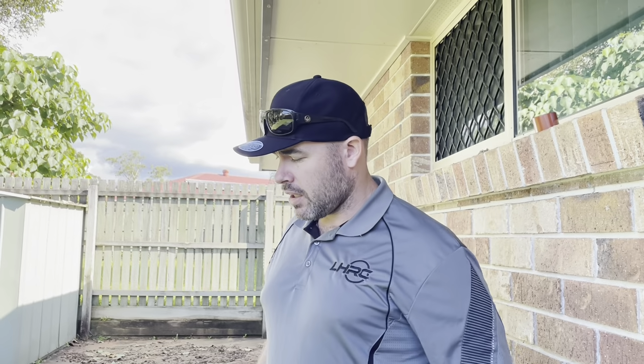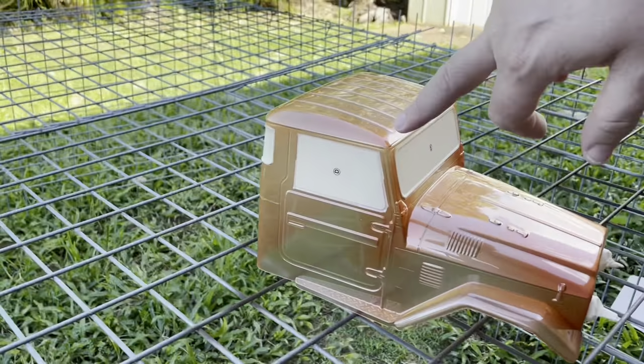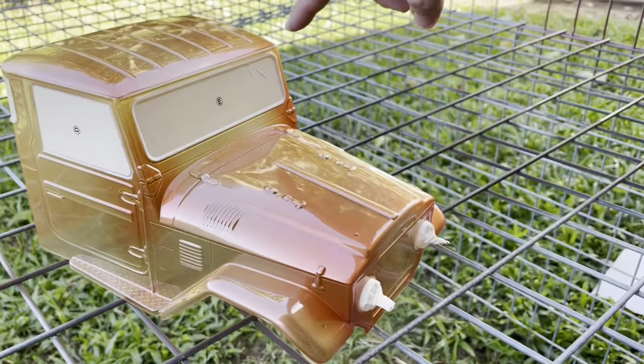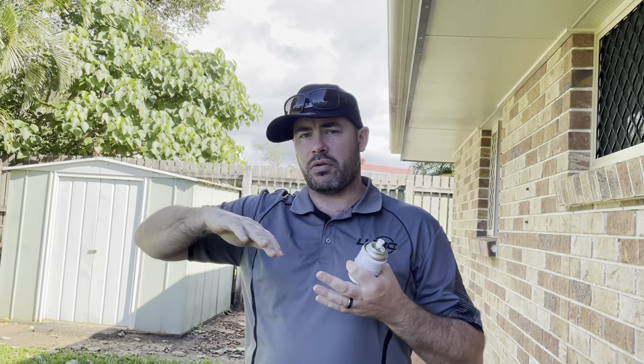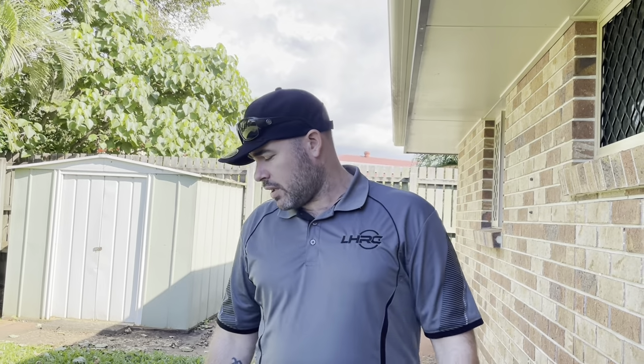So when you sand it back, because this is the inside, we can't change this now once we've done it. But you can see, looking at the body too, that I've hit the corner spot. The bit at the top there, right in the corner in the front, the paint is a lot thicker there, because I want to make sure that when we do the rub back process, the parts that sit up higher are going to cop the most rubbing. So you want to make sure that's got the best paint job all the way through, because that's the part of the stuff that we're going to hit. So what we'll do is, again, we'll get some photos up in this process, and I'm not going to make you sit here and watch me paint the whole thing, but I'll see you in a couple of moments.